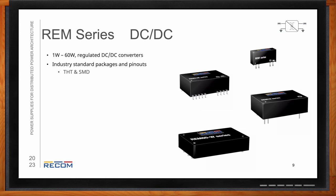and come in industry standard packages and pinouts. We have through hole topologies as well as surface mount, and they're going to come in standard voltage combinations for the input to output voltages. So again, high isolation is a requirement for medical applications. So we're going to have reinforced 2-MOPP isolation as well as 4 kilovolts DC as a minimum. We go all the way up to 10 kilovolts DC isolation for our medical grade.